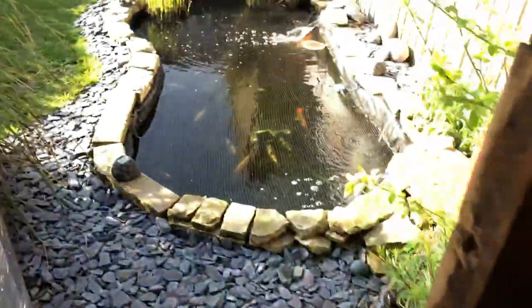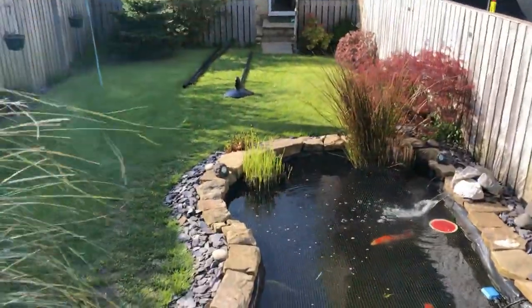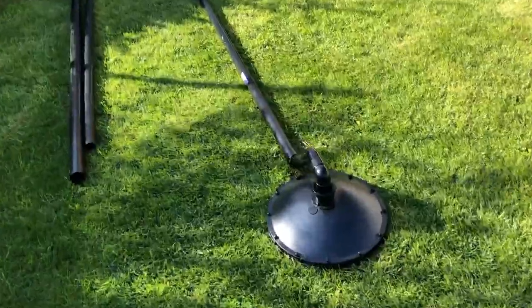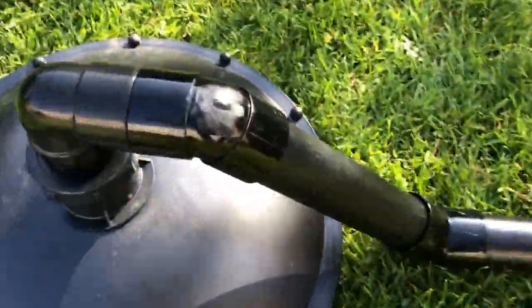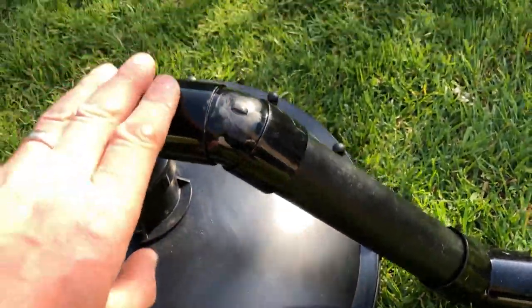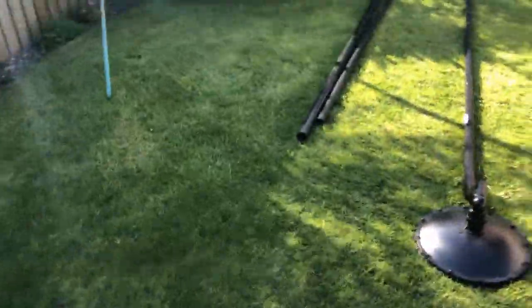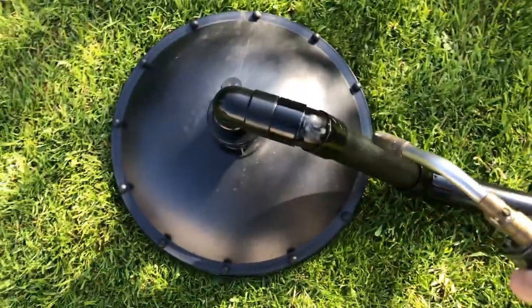Once the pump's arrived, the retro bottom drain, which is already good to go with the homemade loading kit on it, again, I'm going to just sort this out. I'll show you what I mean. I'm just going to warm it with a blowtorch, and it should take that grey looking scratch off by bringing the pigment back up in the plastic to the top. Just give it a quick flick over with a flame, and that should make that look right.